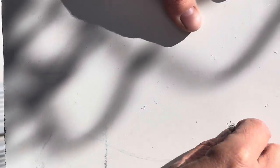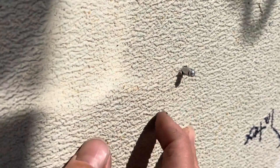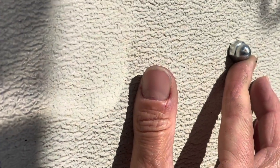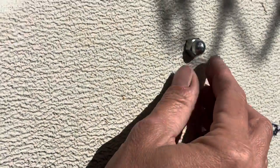Looking in my Scamp rivets I found a shorter one. I take my rivet and go back through my hole to test it. Remember we're not counting the ball when looking at one and a half times — just the shaft. This is pretty good, looks pretty close. If I put an acorn nut on it, it looks like it fits well. So this is the size I need and I didn't have to measure anything — I just used the multi-pack.